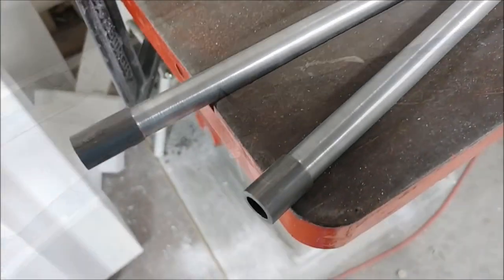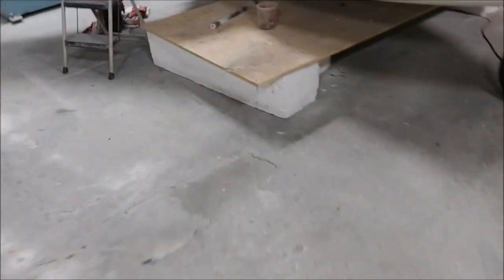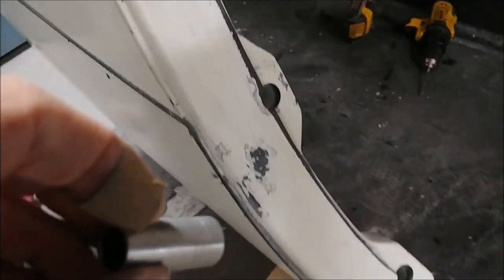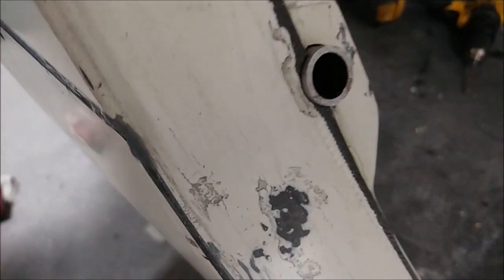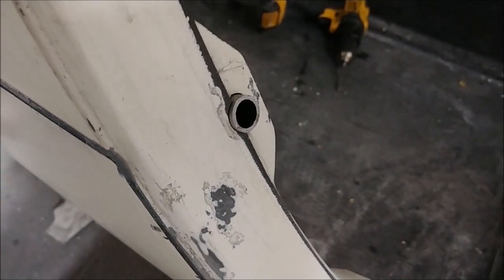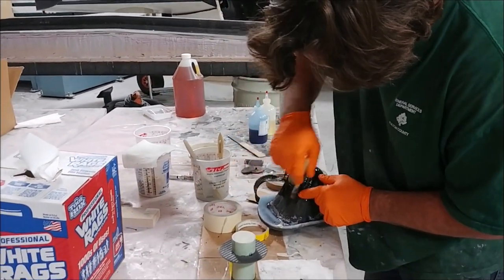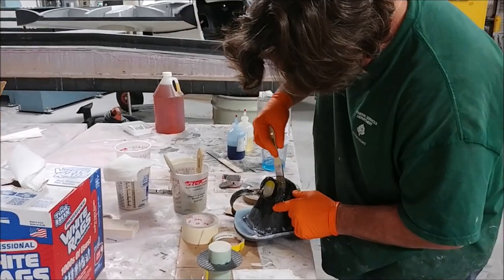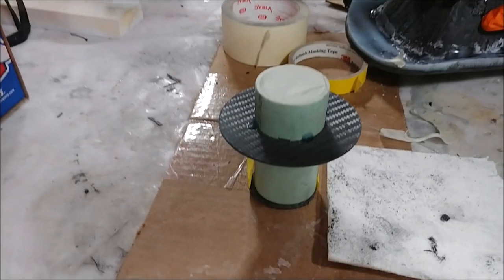Jeff also got the layups done over where those brackets are for the gas struts for the doors, so it just needs a little bit of cleanup. Here are those rods I ran on the lathe — I've got to cut them into pieces that are an inch and a half long. I've got band-aids on my fingers again — I keep hurting myself every day it seems. Those basically slide in there and will be bonded into place with some Hysol, and that's where the pin locks will engage. Pretty hefty layup — I don't think we'll have any problems with the doors holding shut under pressurization.